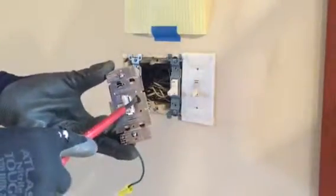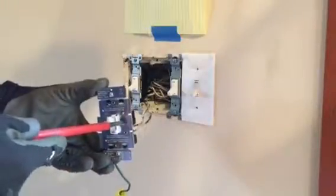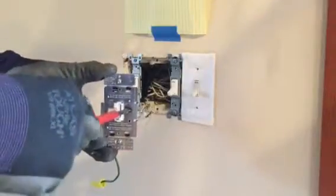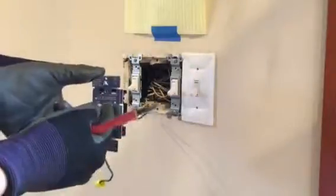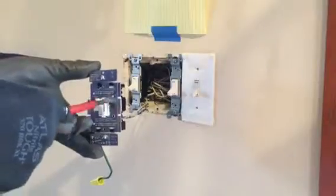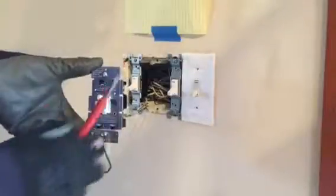The Lutron guy says you can play around with this little adjuster — it's called a trim adjuster. You can make your lights go just that bit dimmer. I turn mine as far down as I can since it's a living room — I want it to be kind of mood lighting, not too bright. If the lights start to flicker or complain, then you may have to adjust this thing upwards — raise the minimum trim on it. Since mine are happy, I'm going to just leave it all the way down.